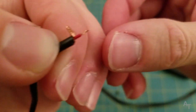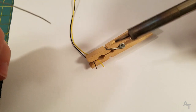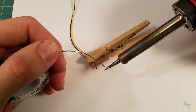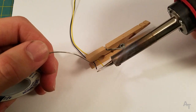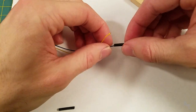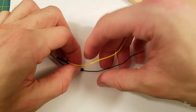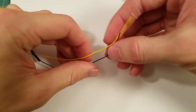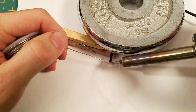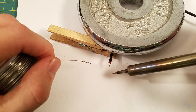I'm going to strip off just a tiny bit of our positive wire and do a little roll action — grip that, boom. Now I'm going to take our two little wires that go to the connector that plugs into our DVR and tin them — meaning I'll add some solder to the ends to make it easier when we solder them to the other wires. Before I do anything else I'm going to add some heat shrink tubing on the ends of these wires, because I can't stand it when I forget to put heat shrink on after soldering. Slide those all the way down and forget about them for now. We do the same tinning to the other wires — don't hold the heat too long otherwise the rubber will start to melt.